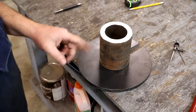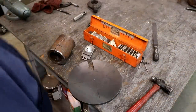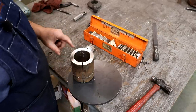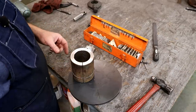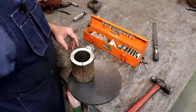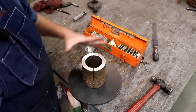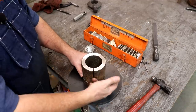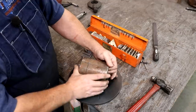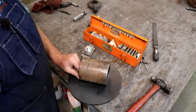I'll just use my miter saw and cut that slit. So let's catch up where we're at. I went over to the miter saw and first thing I did was split this whole piece of tubing all the way up. When I did, it sprung open just a little bit wider than the original gap, which is fine — I need a little gap in there. Because the bottom is going to be welded in place, it wasn't going to leave a lot of flex for this to close up and be held tight. So I made another cut crossways, going about two-thirds of the way through. That'll give me a section that can close up and tighten up on that shaft, which is what I'm after.